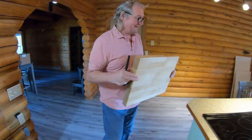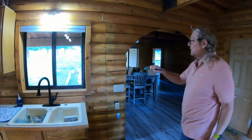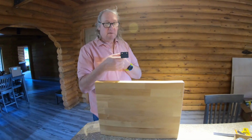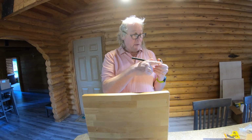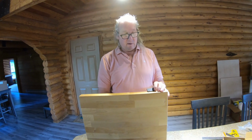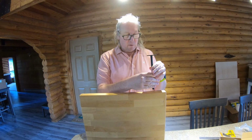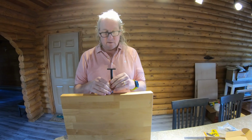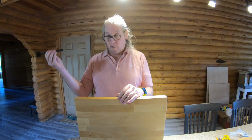Well, maybe you should move it a little bit. Yeah, we'll move that one a little bit. So we'll have 3 of these. And my thinking is, because I need to be able to screw the screws in, right? But if the shelf's mounted, you can't. So if I drill them part way and put these in, then we can hold this up there and mark where they go.